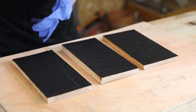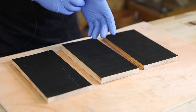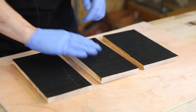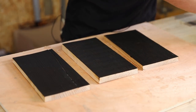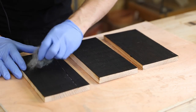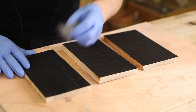So what we're going to do is get some steel wool — or you can use scotch brite, just something lightly abrasive that's still got a lot of flex in it — that's going to follow the grain, and we're going to use that to remove the early wood which is now charcoaly and soft. It's going to turn to dust straight away and just leave behind the ridges of the late wood. It's very easy — just scrub it back and forth like that. I'd recommend wearing gloves for this because it gets proper messy.